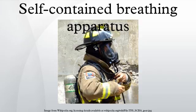The actual scientifically valid change in temperature from 32°F to 96°F is by a factor of 1.13, not three. If an air cylinder is pressurized to 4,500 psi at 96°F and the temperature later drops to 32°F, the pressure gauge will indicate 4,000 psi. Stated differently, a drop in temperature of 10°F causes a pressure decrease of about 82 psi. Failure to accurately account for the effect of temperature on pressure readings can result in underfilled air bottles, which could lead to a firefighter running out of air prematurely.